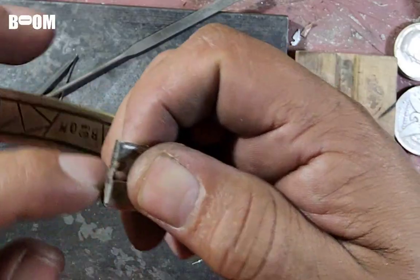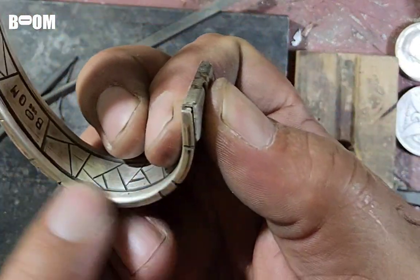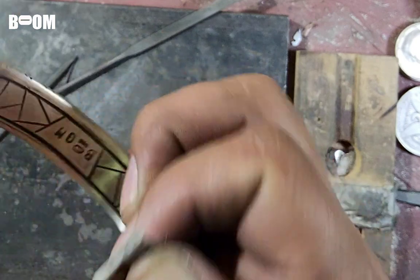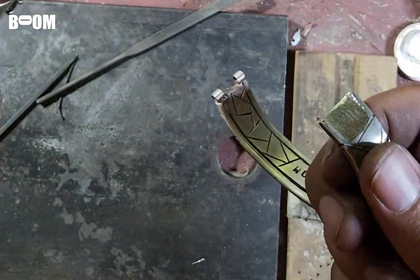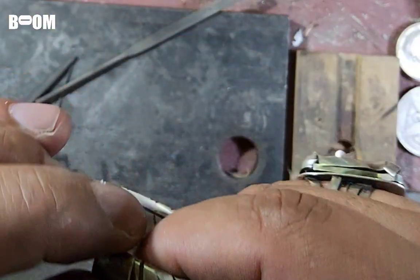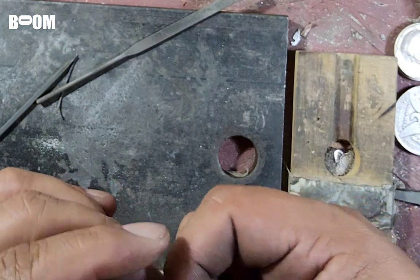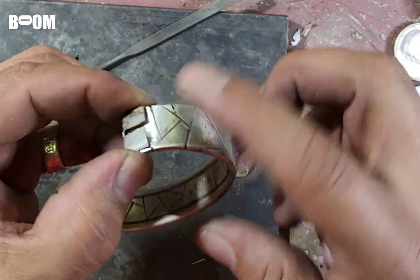Because you know how little thin parts tend to melt, especially as hot as this is going to have to get, or there's going to be a lot of mass here, and I want to have good balance between this piece and this thin little piece and this big thick mass. I've got to get both temperatures to come together at the same time. I'm going to fine tune, and we'll probably get ready to solder this bad boy on, see what it does.